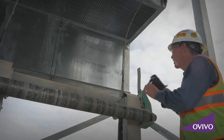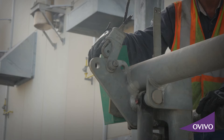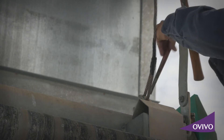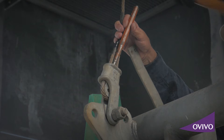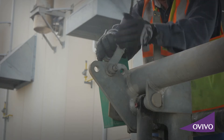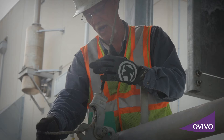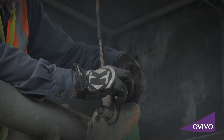I'm going to cut the electrical tape. I take my hammer — there's a wedge on the inside — and I tap on it just a little bit to make sure it's loose. Then I take a punch, put it on top of the wedge, and drive the wedge out. I gain a little more slack in the cable, pull the wedge out, take the cable out, and pull it completely away from the machine. Just let it hang — it's fine. Now we do the same thing to the other side.